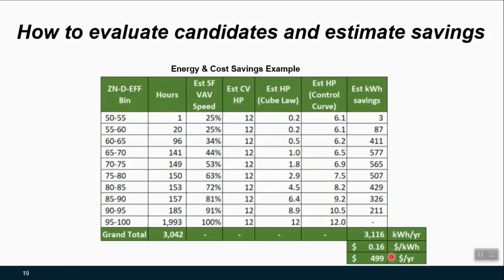And if that payback wasn't sufficient based on what you might expect, whether you do an in-house VFD addition, when you're adding that airflow monitoring array, you can look at the heating and the cooling savings using that same bin information to try to get some rough savings for what my boiler can do with less flow across that coil, or how much chiller savings I might have in my plant if I don't need to send so much flow to that chilled water coil on the cold deck.